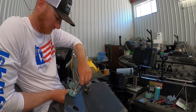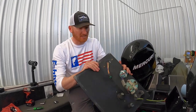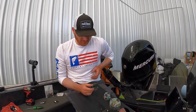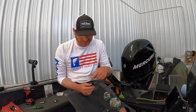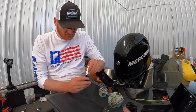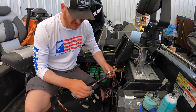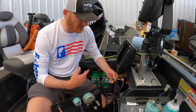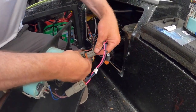We're securing the little Ranger panel here that's going to run pretty much everything on the boat — the live wells, the bilge pumps, the nav lights. We've made this little harness connection, and before I close this up I'm going to put a little bit of dielectric grease in each one of the female fittings. Anytime you take these apart, that's always the tough one to get cleaned. One of the first things I did before I tore this apart was put a label maker on each individual thing — which is a good idea not only for working on this panel but if you disconnect it at any point, or anybody's working on the boat, it's going to save a lot of time.